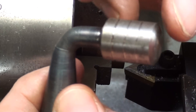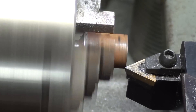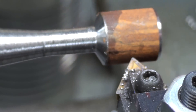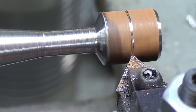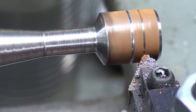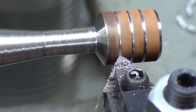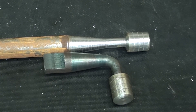This is just a little bit too long, as is this, so I'm going to face it off — it's 5/8ths long. Now I'm going to put three decorative little grooves in there like this. I should have done that earlier when I had more rigidity. This is kind of risky with so much hanging out — it may not work. So far, so good. I have not cut it off yet.